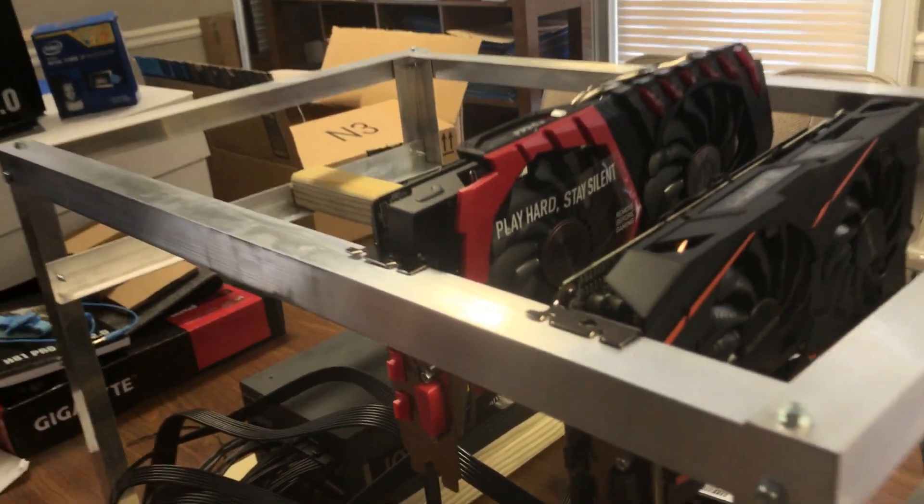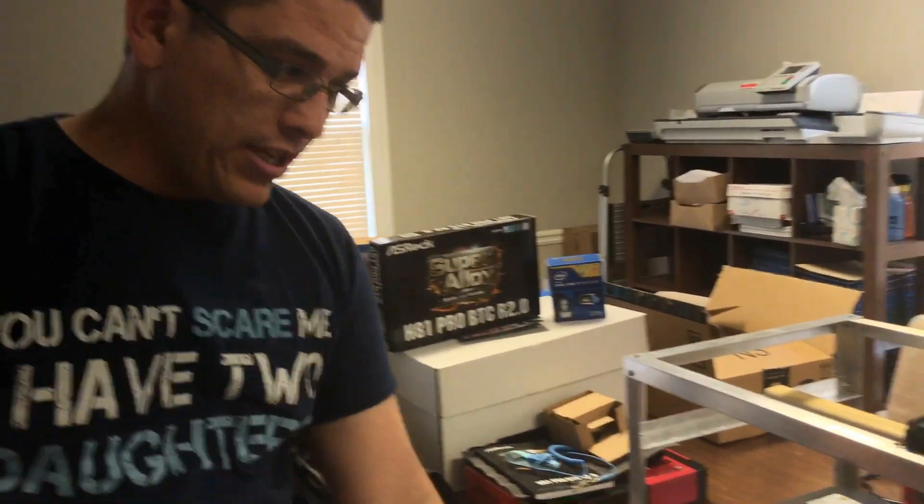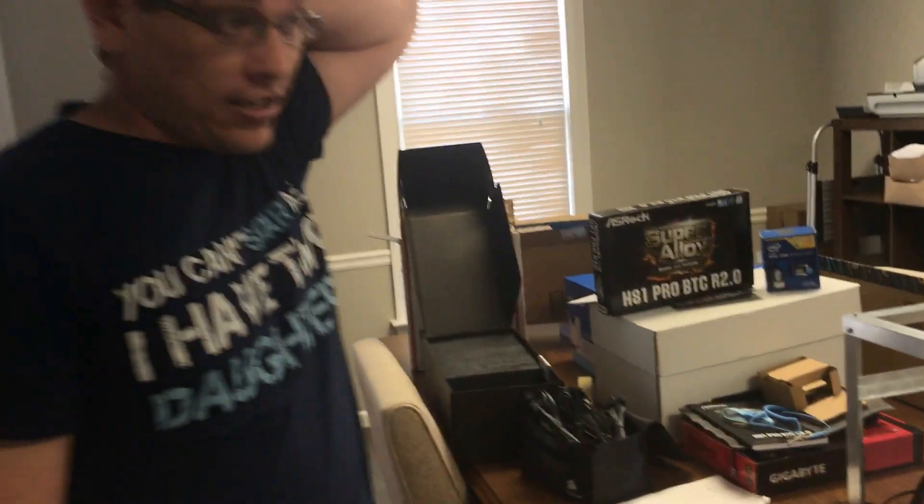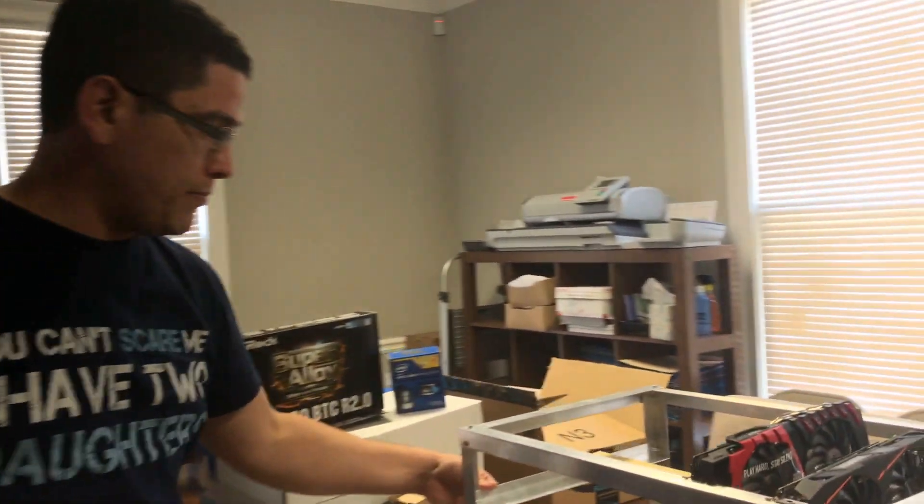You can see how well the cuts keep a straight line — it comes out very flat. There are miter boxes that keep your blade in a straight line as you're cutting; I used one of those and just kept it steady with my hand. The hacksaw was also good for precision work — this piece right here didn't fit originally, and I was able to just saw a little bit off without having to take a big chunk.